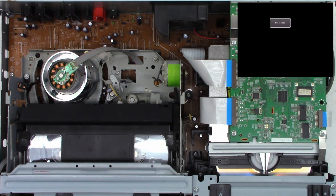Next, I need to go ahead and service the movable portion, which is basically done by just dragging the stainless toothbrush in one direction just to clean the contacts a tiny, tiny bit. And then I just want to wipe them off. Just like that, you should see definite shiny points on the switch. Just like that, when you are done.